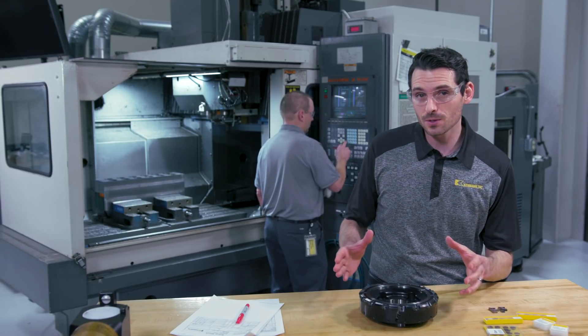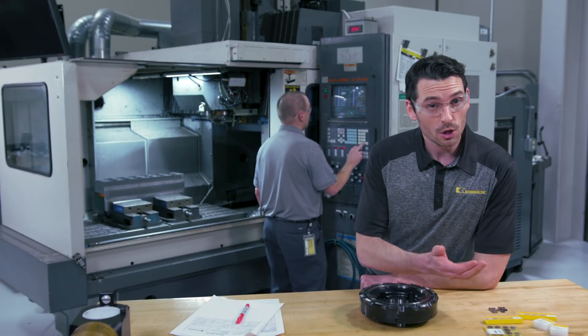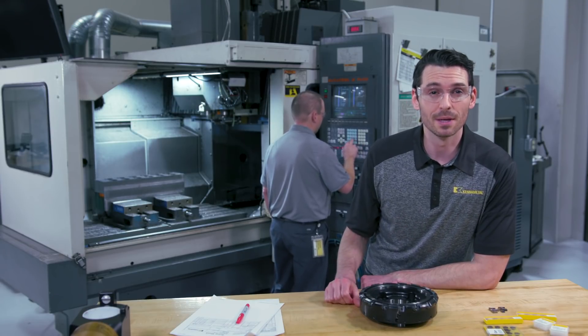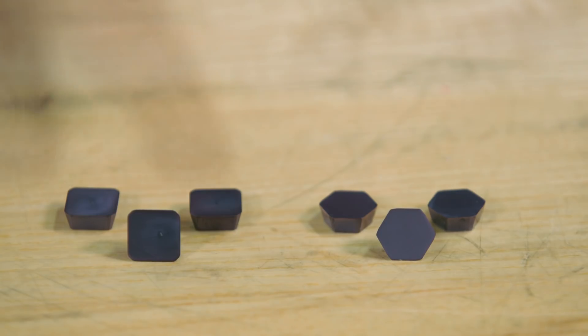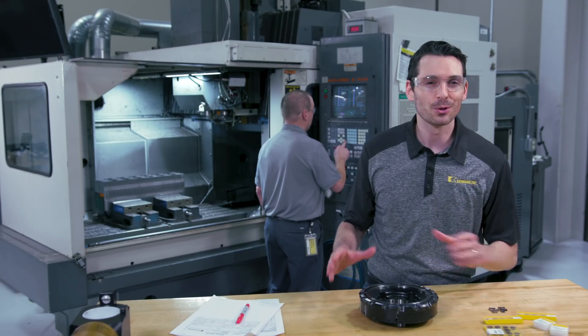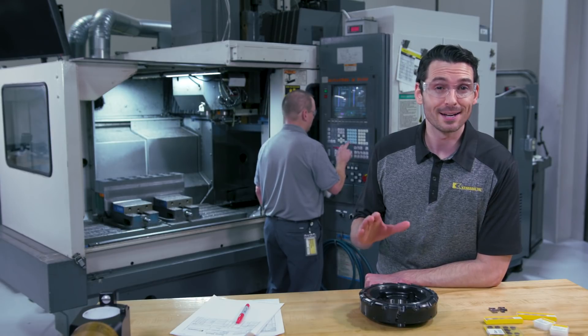For the inserts, we have three options for the KCFM45. Carbide inserts, which are ideal for machines with lower spindle capabilities — we have carbide semi-finishing inserts and carbide finishing inserts. You'll be surprised at how good the surface quality is that this cutter achieves with just carbide inserts.